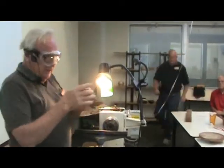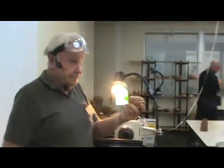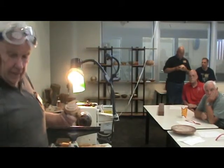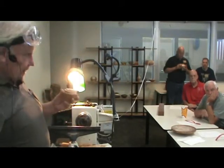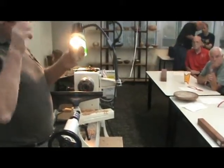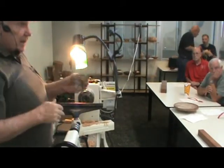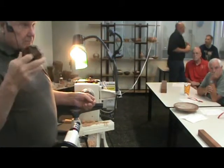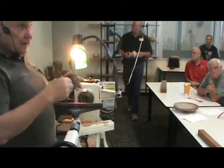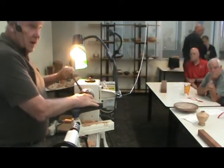When I started this project, I made three waste blocks like this because I was going to make three pieces. I started them all on the same kind of waste block — just cut a tenon on a three-quarter inch piece of pretty good strong wood, and then flatten this and glue my first ring on here. And I have something to hold on to this end of it while I'm working.